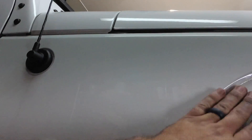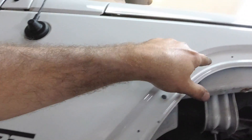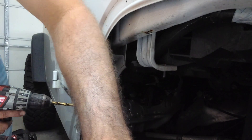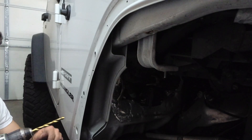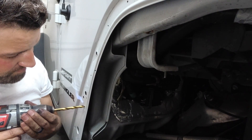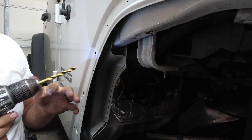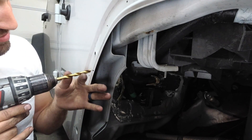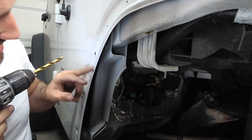These are the holes you're going to have to drill. We're going to go back over these holes and drill them out larger. Now we've got the 21/64ths; we've already opened that hole, so we're going to work our way up. That's going to deburr everything. The challenging ones here I'm going to go ahead and try to do now — I said I was going to go back the other way, but I think I'll just continue on this way.